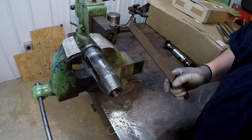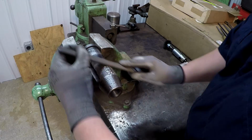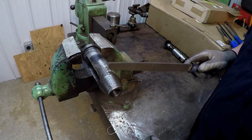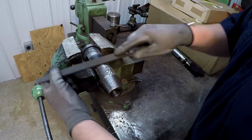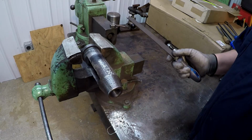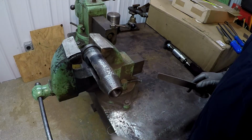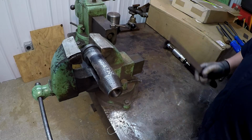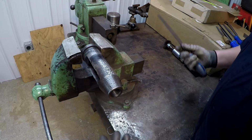Draw filing is a technique, and it's perfectly fine. It works great. That side-to-side motion on a mill smooth file is going to create a nice flat uniform cut for you. If that bothers you, then you just need to look away and get over it, is what I've got to say, because I ain't going to stop doing it because a couple guys think I'm filing wrong. Now the other thing that they say is, oh well, you're not supposed to drag the file back on the back cut. It's obvious